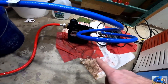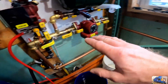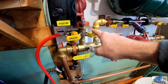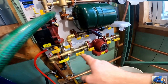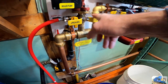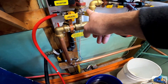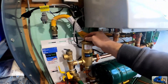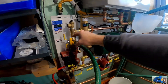We got all the valves open, except one critical valve that needs to be closed — that way it forces the fluid around a certain path in the system instead of having two different directions to go. So when we start pumping: this valve will be closed, we'll open this one, and we'll open this one to dump it out. We also have to make sure we have the air purge closed off. Then we'll start pumping, open this up — there's no pressure in there right now because it all bled off from air bubbles.